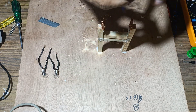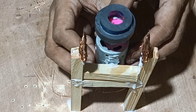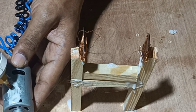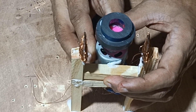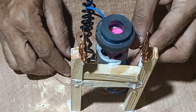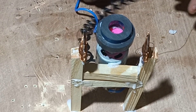Once the winding is completed, next we will fix the motor with the round magnet over it to move in between the two blades with copper winding so that maximum flux may link and we can generate EMF. Apply glue to the base of the motor and fix it to the wooden stand. Fix the motor so that the magnets rotate in between these two coils wound over the blades. Once attached, we will connect the two terminal endings of the blade coils.